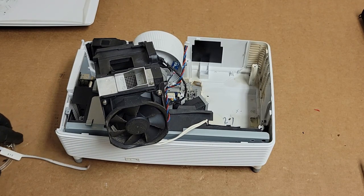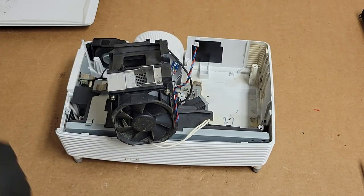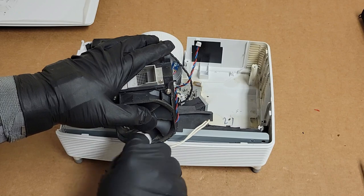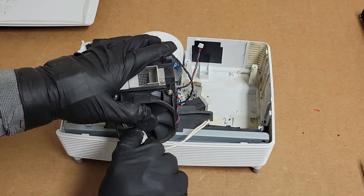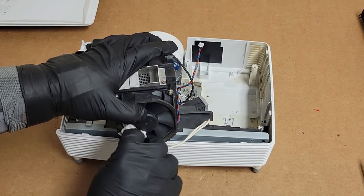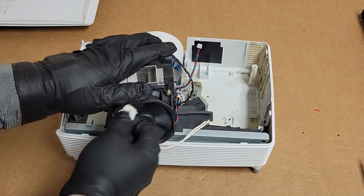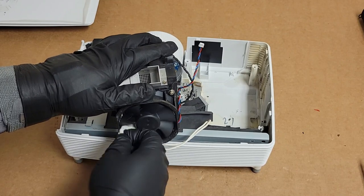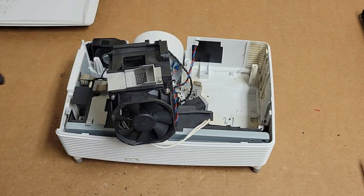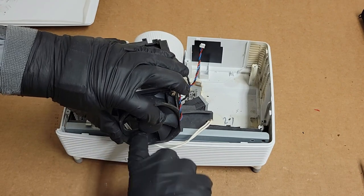Now we're gonna clean this up before I put the new wheel in. Fan's not too bad. Get that paper towel that I was using on that other wheel, get those leading edges cleaned off. I don't know how true this is. It would be an interesting experiment. But my understanding is that when the front of those fan blades get encrusted with dust like that, it messes up the airfoil shape. And that makes the efficiency of the fan blades drop off pretty far.